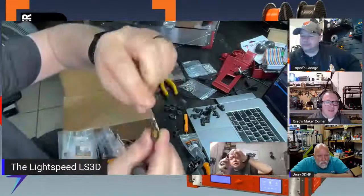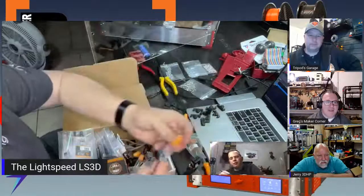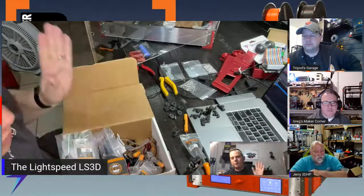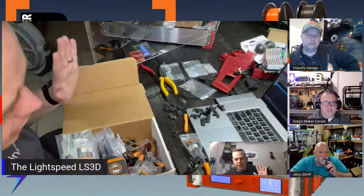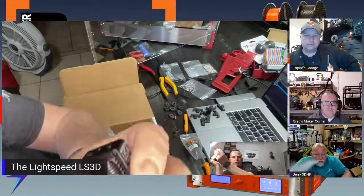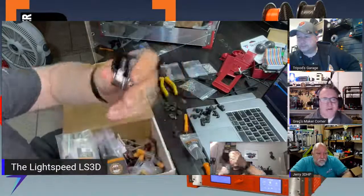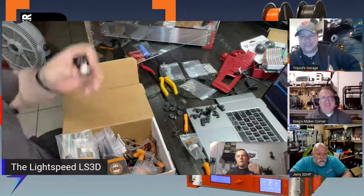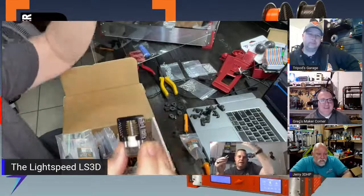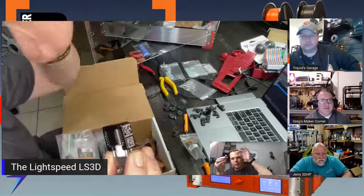And this thing is so weak. I hate to say weak, but it's so thin. So Slice recognized that, hey, we're replacing a lot of hot ends. Again, I'm speculating here, but I know it happens. And so they came up with this new design here that is reinforced. It's the same thing, just reinforced. A little more idiot proof. They always make a better idiot. Because people always want to jam a wire down in there to fix it. And it's the wrong way to fix it. The right way, if it's really, really jammed up, is you take it apart and then you heat it up and pull it out.